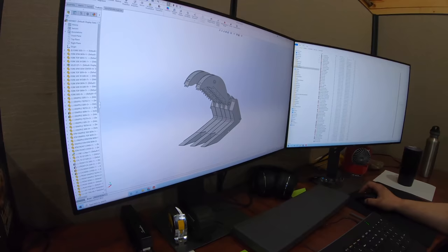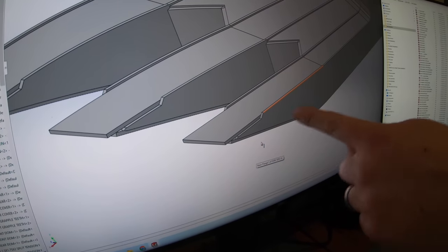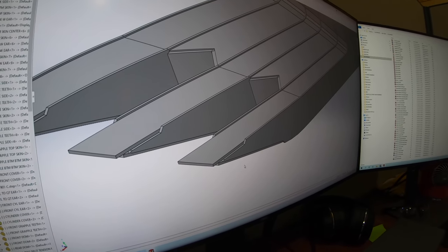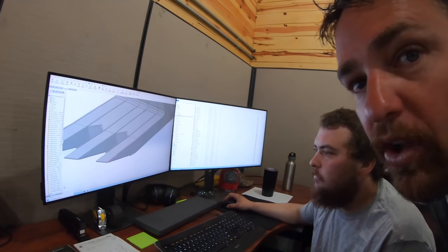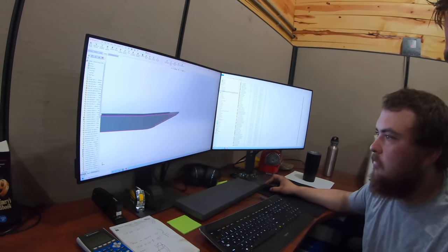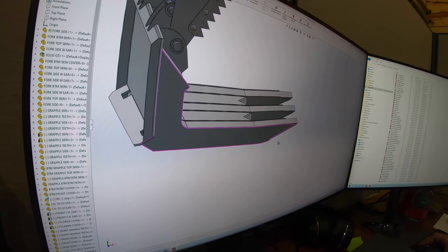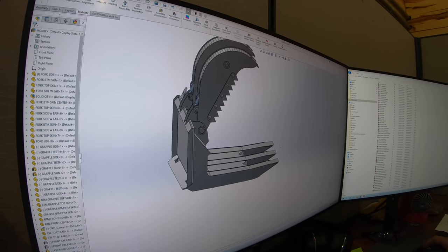Well, the only thing that we're worried about is, it almost gets utilized like a fork. We brought these two pieces up and we're meeting and putting a weld. One of the worries is that it's going to wear over time. So we do feel if we put this in production that they should be a solid steel chunk that's milled down, kind of like a fork. That way as it wears, you can just keep sharpening it with a grinder. But I think for the first prototype, we're going to do it this way because it's easy and fast, less machining. Long term, it's a part that we would have to machine out.